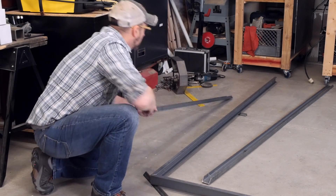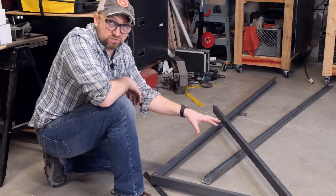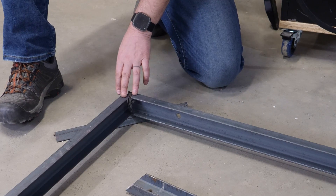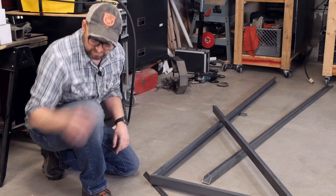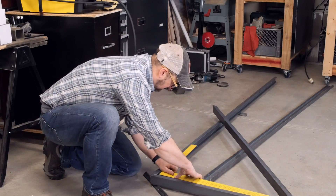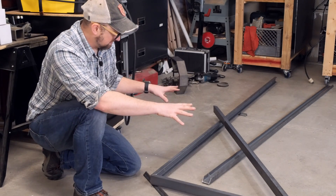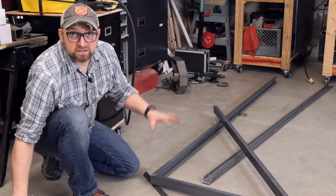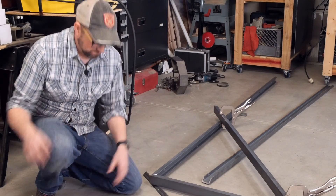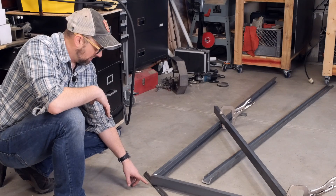I've isolated the parts from the floor, and I know it's completely level. One other thing I can do is clamp a piece of steel — you can use a piece from your trailer frame — across there just to make sure they stay in place as we put heat into the corner. Now we need to square it up. Method one: use the largest square you have to be as accurate as possible, square it up, then clamp those pieces to the cross member.